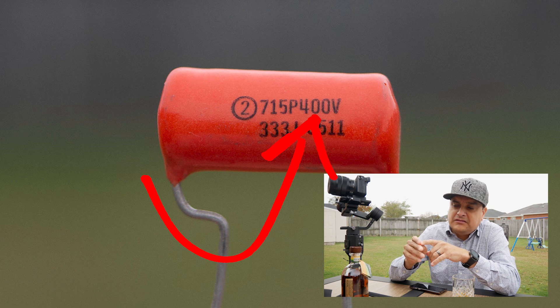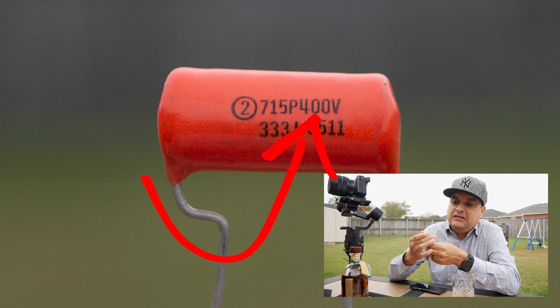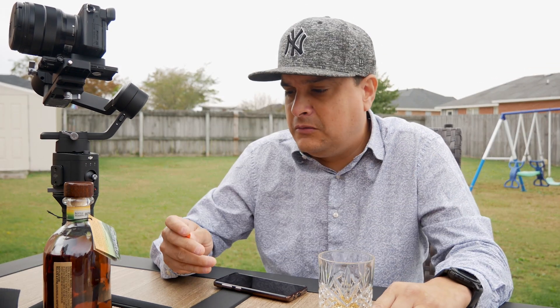Next we have '200V' or maybe '400V' or '100V' — you guessed it, that's volts: how many volts this capacitor will take before it burns up. Just remember this: none of the numbers in the top line matter in a guitar. People will try to tell you voltage matters — it does not. People will try to tell you those cheap little caps in your guitar need to be replaced with some big fancy thing, but honestly it's the same thing. You're only going about 300 millivolts or so, so voltage doesn't matter in a guitar. Don't let anybody convince you otherwise.